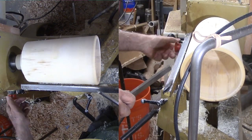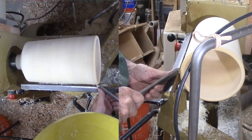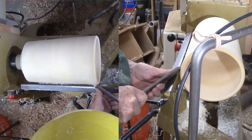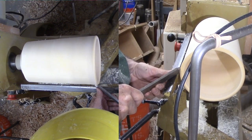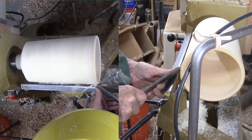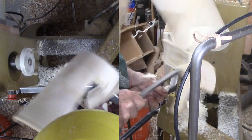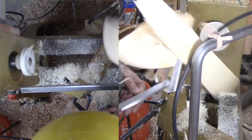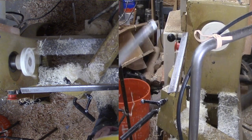Then trouble. I have noticed a little wobble that I attributed to wood movement due to wood removed and moisture loss. I don't know the exact root cause of the explosion. Definitely there was a catch with the skew, but I'm making the same stroke as several previous ones. One difference is that I'm working on the very end where the wobble is worst.